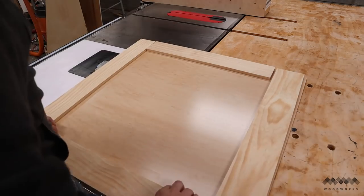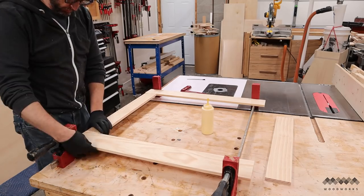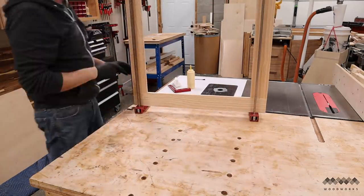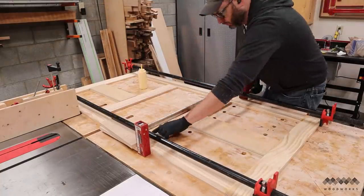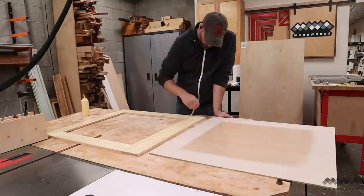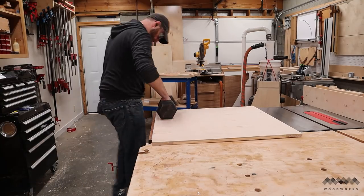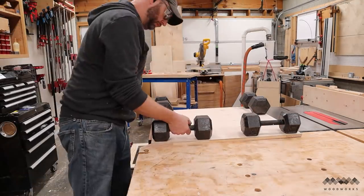The last detail to tackle before everything got painted was to make the side and back panels. These are just going to be made from quarter inch plywood and half inch material for the border detail. I'm just gluing these frames together since this is trim and there's no need for more structural fasteners. I did the same thing for the back panel, using scrap ply as spacers to make sure that I got my stiles evenly placed. Once the frames come out of the clamps, I spread some glue on them and sand the plywood where the frame is going to sit because I'm using pre-finished plywood. I just added some heavy things to act as clamps since I was already using most of my smaller clamps on the face frame.